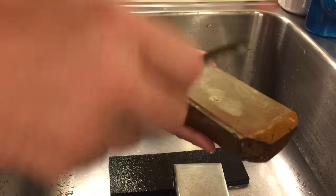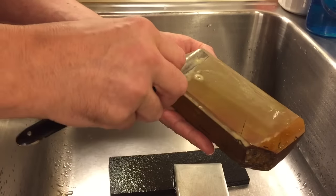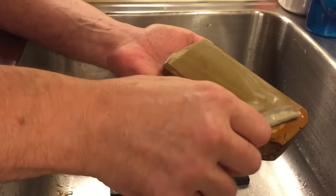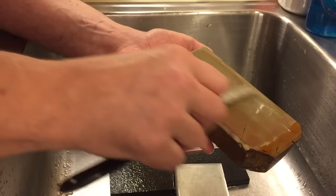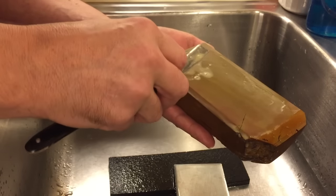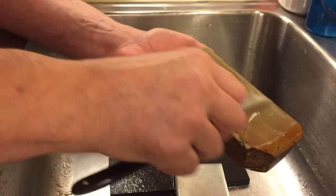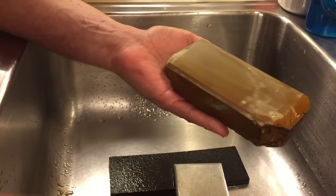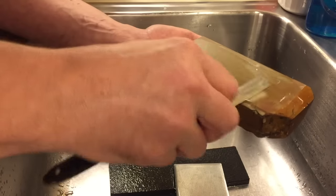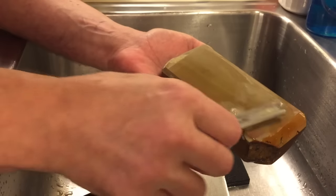You see how that drips? To me, that's good. There are varying degrees of that and people want to describe it — oh, it's like milk, it's like cream, no it's like yogurt. What's important is that you develop a thing. You know what your consistency is that you're going to work with, that works for you, and it's important that you maintain that when you hone. What somebody else does doesn't matter so much. Now, if this gets into being like mud, you're screwed — that'll kill your edge. If you make it too thin, it might take a little longer. You have to figure your stone out.